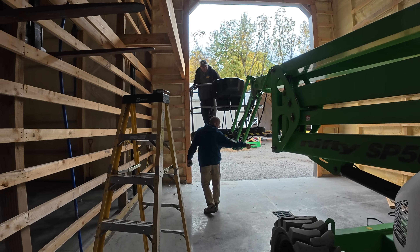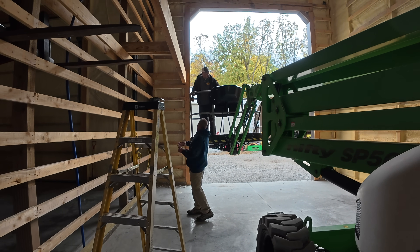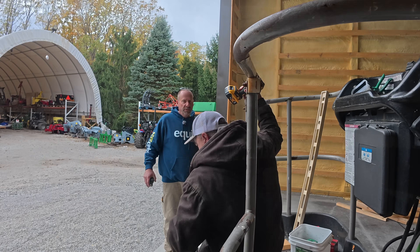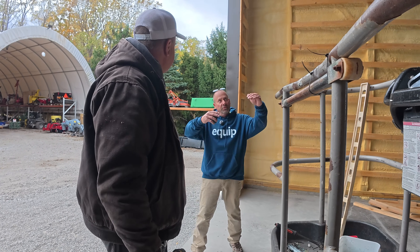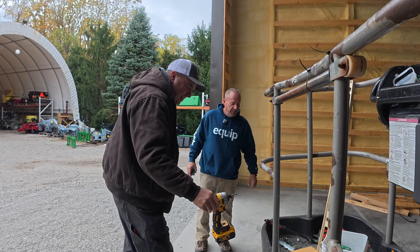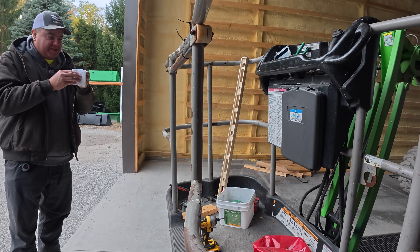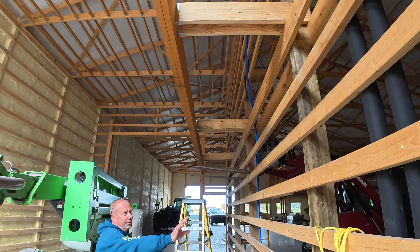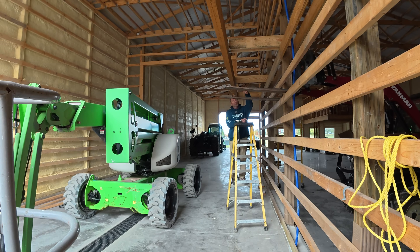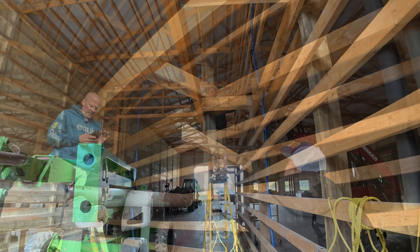So what we're going to do is cut up some scrap two-by-four and put it between the 2x8s horizontally. We'll split our seam on that because these are eight feet on center, using two of these little straps. You put them flat ways in between those two, put your seam right there, and you've got a five-inch joint — actually six and a half inches to be exact since it's already three and a half inches wide. It'll work beautifully. We might not even have to cut them; they don't have to fit perfect. We'll figure out our joint spacing in between.